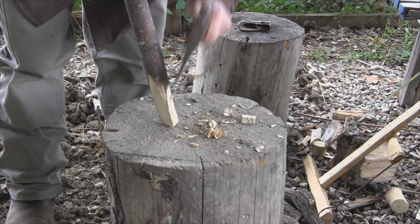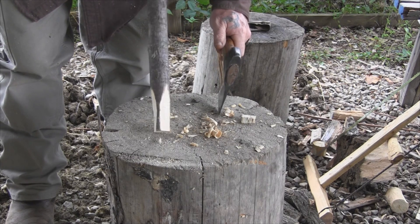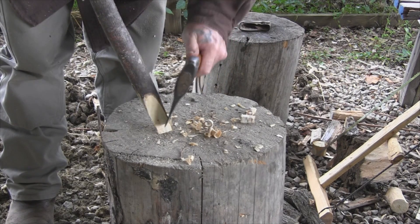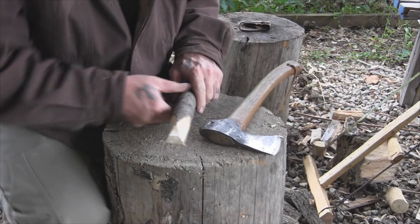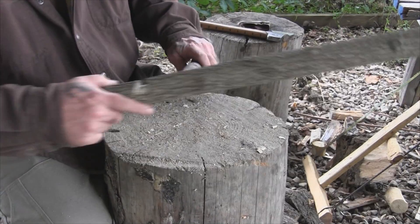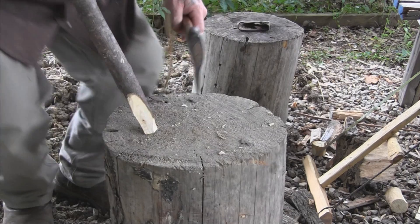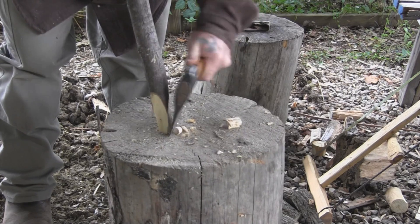We could also do this with our knife and dress it up on smaller pieces of wood — on larger pieces it's a little more difficult. Now we're going to take this front part and cut it off, which will give us our dovetail with the two angles. We need to match it up and see if we need any trimming on this dovetail. It's meant to fit inside here just like this, and you can see that angle needs to be a little steeper on both sides.